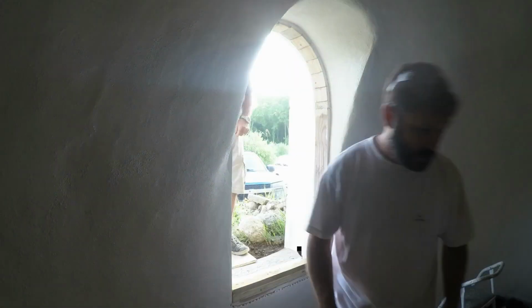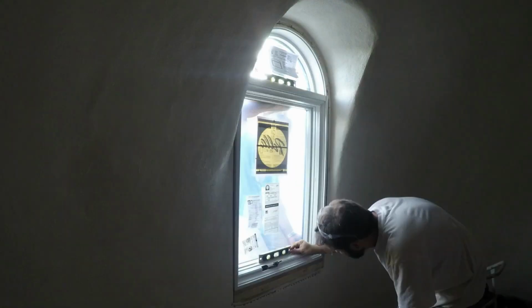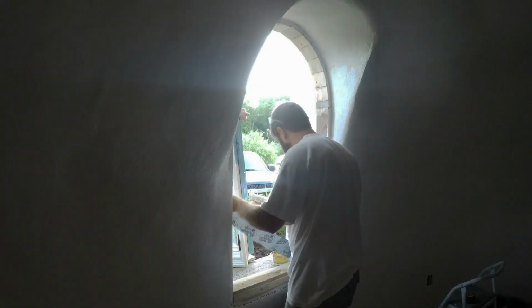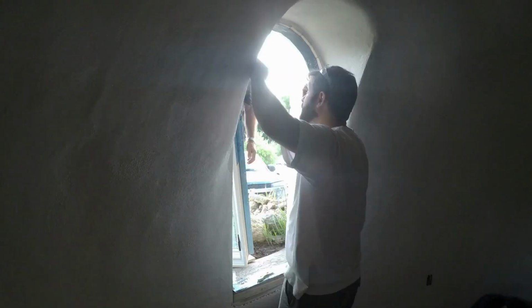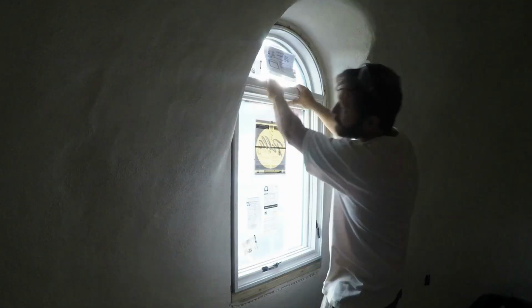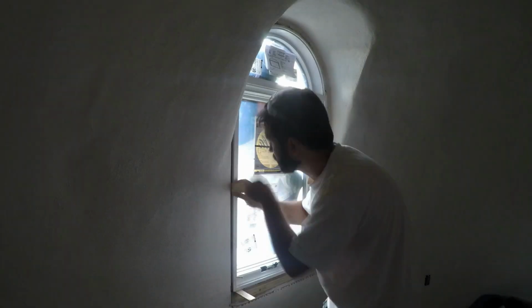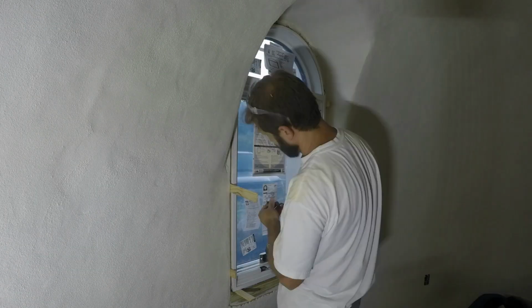This is my fancy office window. It's the only arch top we bought for the whole house because they cost about triple what the other windows cost, and that was for one where the arch part doesn't even open. First we dry fit to make sure it can go in nice and level, then we tape it. This time I'm using this stretchier black window flashing tape that handles the curves much better. It was probably about twice the price as well. The window went in really nice and snugly with just 1/4 inch left for adjustment, but that was just what we needed.